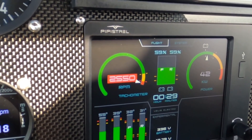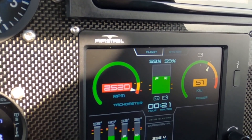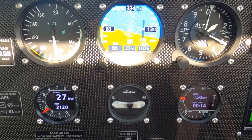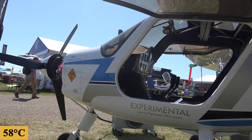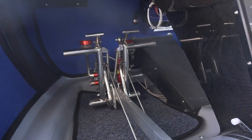There is also a second, small warning panel specifically designed to warn about battery over temperature. It is analog and consists of battery temperature sensors and two warning LED lights — one for each battery pack — which illuminate if the battery temperature exceeds 58 degrees Celsius. At the base of the panel, and looking somewhat dated, is a classic slip ball.